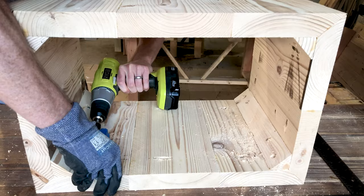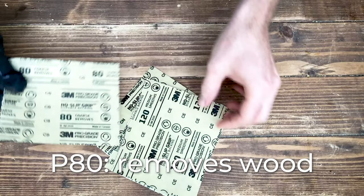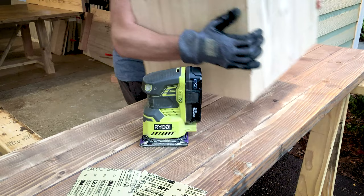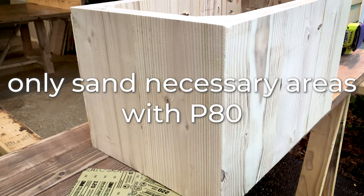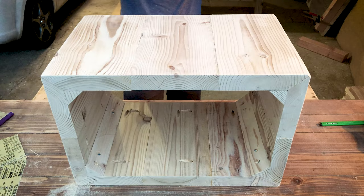Now I'm ready to sand. Here's a crash course on the basics of sanding — you only need to worry about three numbers before staining. An 80 grit is used for removing large imperfections in the wood. A 120 grit is used for smoothing out small scratches and imperfections, and a 220 grit is the finest you'll ever need before the staining and finish process. I'll introduce one more number when I place the clear protective coat on. Using a palm sander, I'm going to start with 80 grit sandpaper for areas of the piece I need to remove material, and I also like using this grit to round off corners. Once I'm done with the 80 grit, I need to remove the dust particles before moving on to the next tier in sandpaper, to ensure I don't scratch the surface with loose grits.